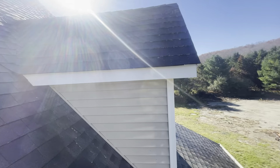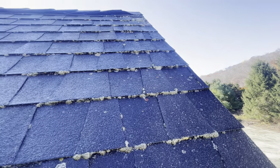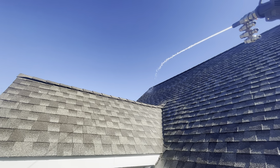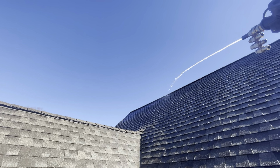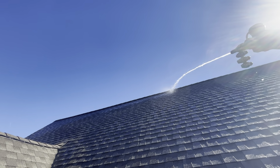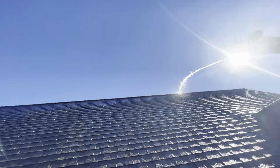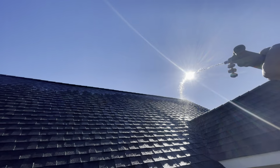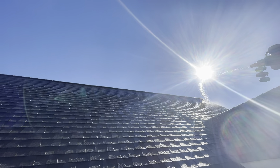You can tell pretty quick if you're making the reaction or not — this stuff has turned white pretty quickly, so I know I've got a nice hot mix. Now for the favorite part of the day for me: taking the shooter tip, shot peak to peak, standing right in the middle here between these dormers. Now that I've got a nice mist on everything, I'll give it my final saturating coat and we'll be able to get down confident in our process.